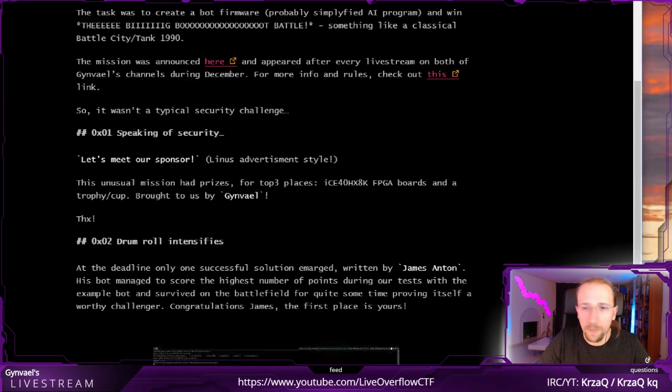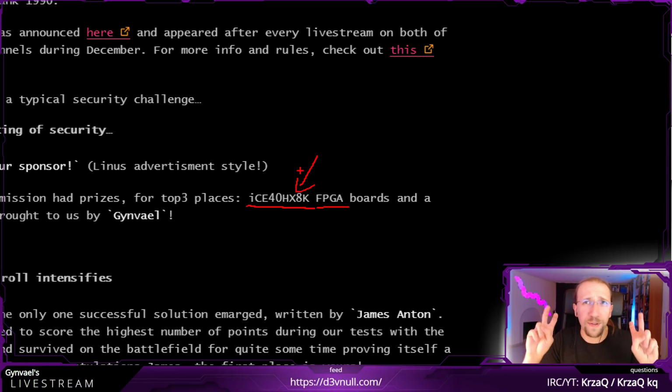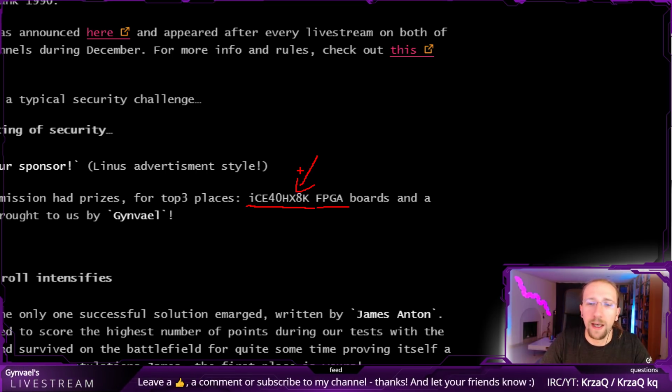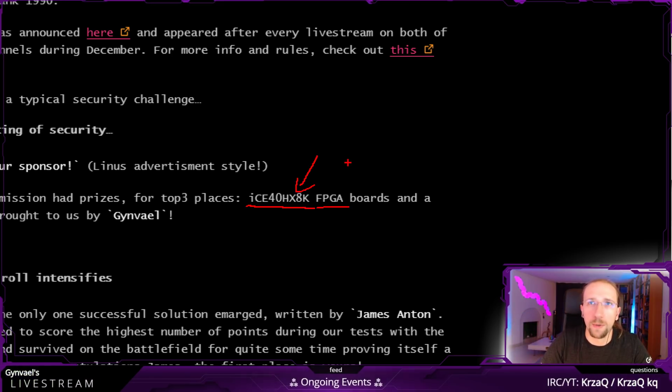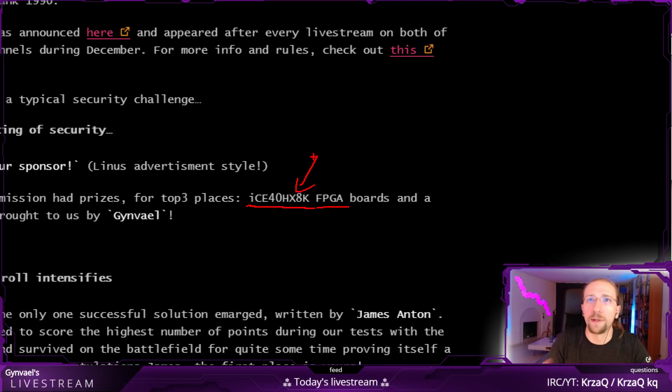an FPGA. This FPGA board from us. It's somewhat called an open source FPGA, which is not really true. The FPGA bitstream has been basically reversed, and an open source toolchain was created for this FPGA. So there are some open source tools for it, which is pretty unique in the FPGA world. So this board with this FPGA is actually pretty fun to play with. I have one of these in my collection as well.